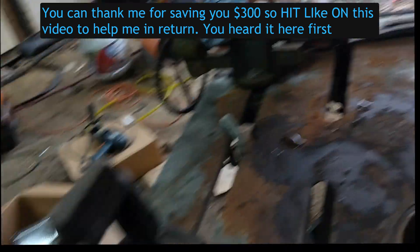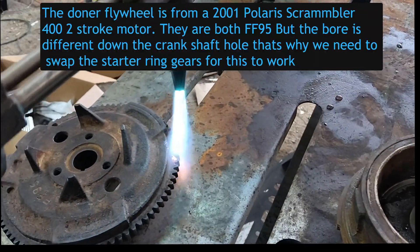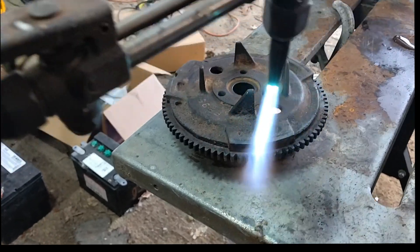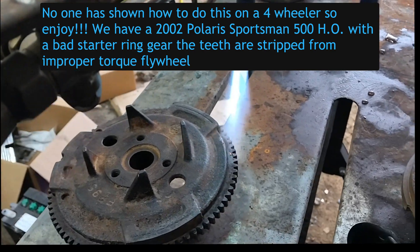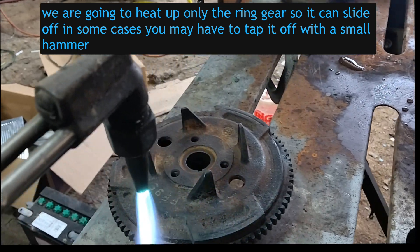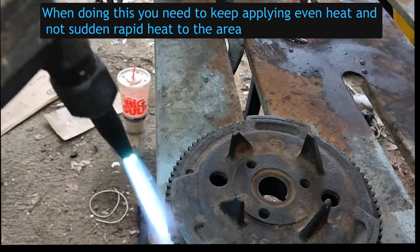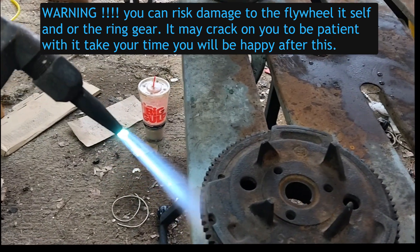So here's what I'm doing, torching it on the ring here. You don't want to hit here in the center — it'll counteract what you're doing. I'll try to keep the video to progress here a little bit, because when you start seeing the little middle golden red-orangish color, you don't want to keep making that happen. You want to just try to get that gear to heat up in the troubled areas — that's where the torch can't get into the gear enough.